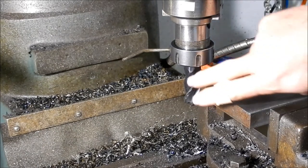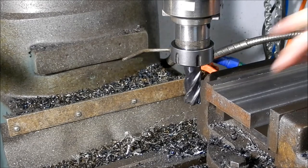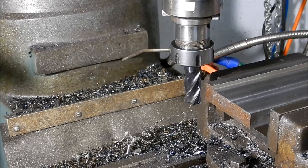We'll mill the ends on this. I went for the carbide cutter — the high speed steel one had a set of teeth on it — so this will give us a better finish. I'm going to take around about 0.12mm off this edge, then come back to the other side and mill it to length, which is 210mm.